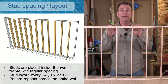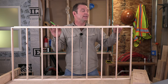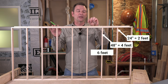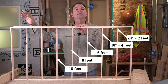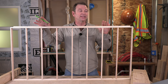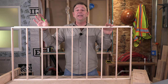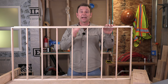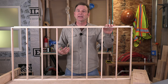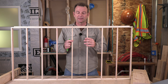This happens to scale down to 24 inches on center. That's a very common layout pattern — if you were to run a tape measure on this you would have a common stud at 24, 48 inches, 6 feet, 8 feet, 10 feet, 12, 14, all the way down to 16. You might see a wall laid out at 16 on center, giving every 16 inches a common stud. You might even see a 12 inch on center wall. As we decrease the space between them we're increasing the number of studs and the wall gets stronger. Depending on the specs of the plans any of those layouts can happen on any building.